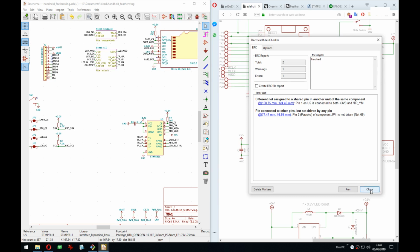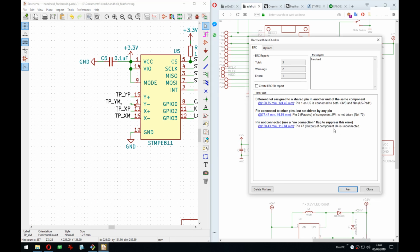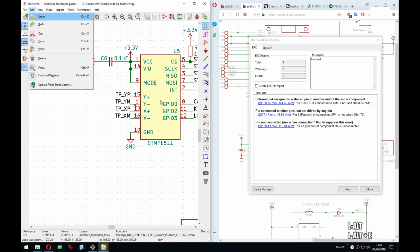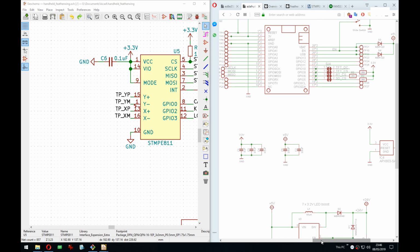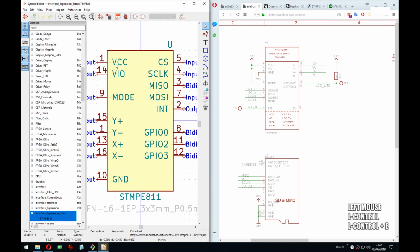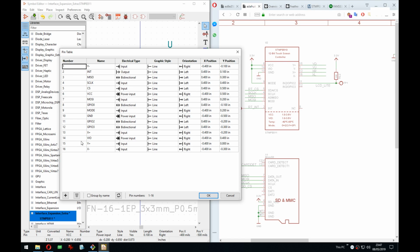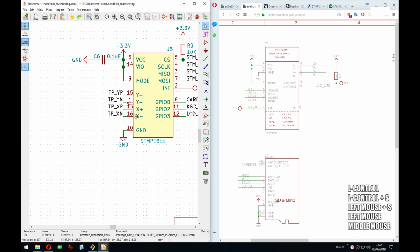Yeah, so there's now only one mystery. What the heck do you mean by this? Oh, I see it. Pin 1 twice. So what should it be? This is Y minus 1. So VCC is 6. See, I didn't do the check. I got too lazy. I should have checked here. Exact mistakes. This would have showed me that I have pin 1 twice. Not good. Yeah, that will shut up that error.